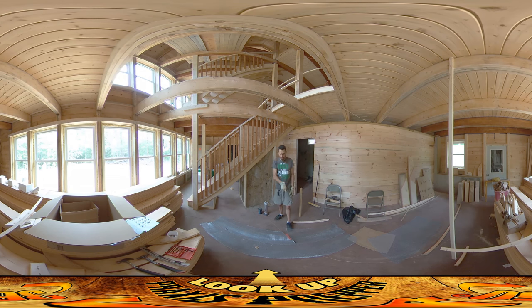I just want to show you how I'm cutting the lath right now. I've got this piece here on the floor that's going to go up in this section. One really cool way of getting a straight line on the lath is to place it down on top of a straight edge — you could use a board or anything that's straight. I happen to have a seam in the concrete right here, so I marked the spots when I had the lath up and now I'm just cutting between the two.